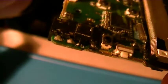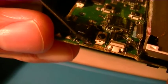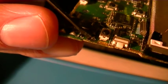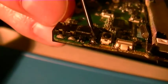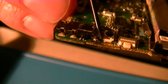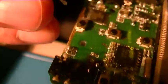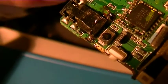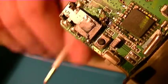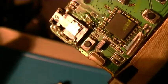Before I put the glue on, let me show you what I did. Right there — this is where it was originally soldered and that was supposed to hold it in place, but it peeled away. I actually have a little piece of the board that pulled away. There's a tiny trace run right here. What I did is I took a little piece of wire, ran it underneath, connected to that, and soldered it. Then I did the same thing on the other side — ran it underneath this piece to that piece there. It was not a lot of fun, but it seems to work.